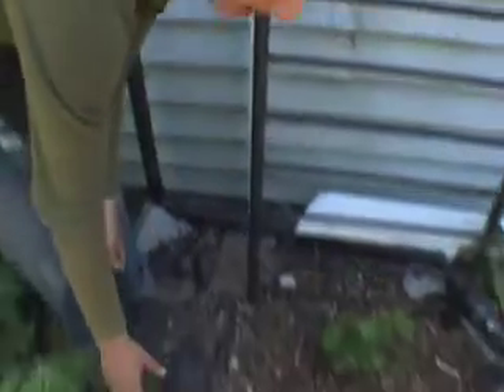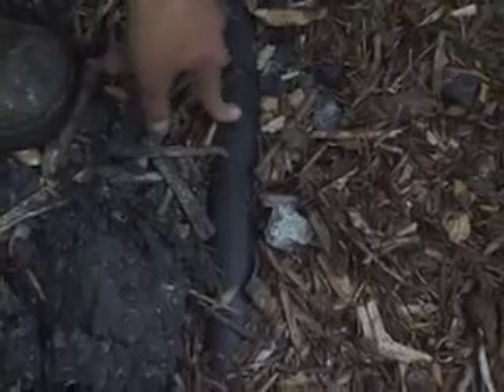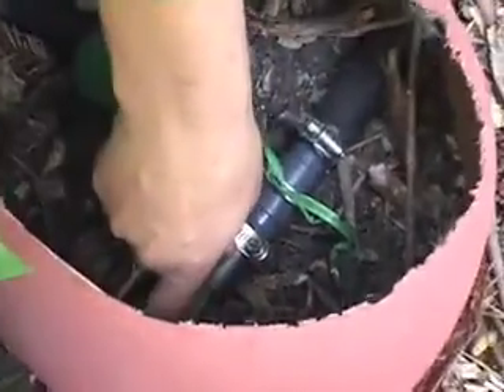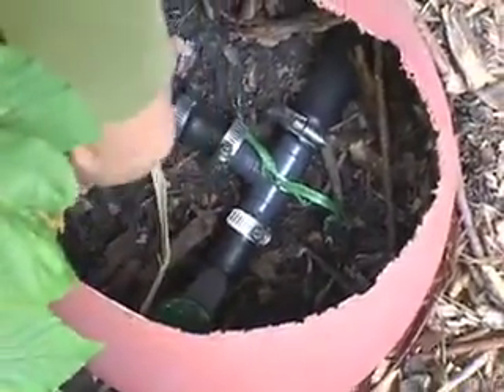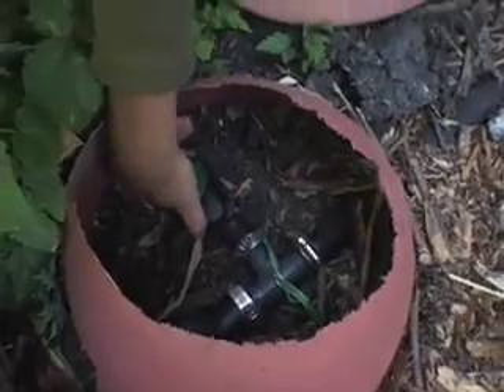If it was smaller than one inch, it would add too much friction. If it was larger, you would lose that pressure. So when the water comes out it's being pumped. It comes down here and we transition into this one inch polyethylene — the HDPE piping — which we use into the landscape. Here we have two different lines. Right now it's going to this line, but if I open this valve, I can actually have a different gray water line — two different zones irrigated separately.